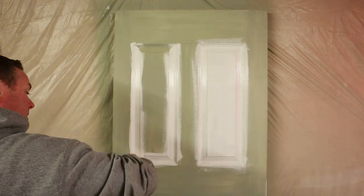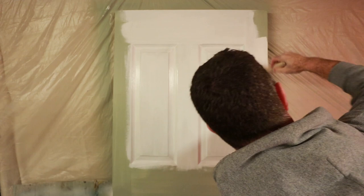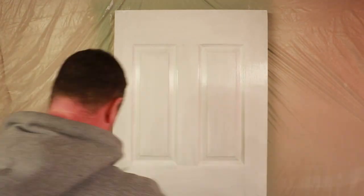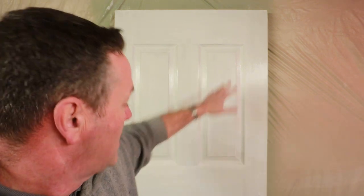Going into speed mode to finish this door off. That's gone on quite nicely. I've got a dry surface because that particular Hammerite undercoat I used is a dead flat finish, so anything you put over it probably will pull. This being an eggshell finish it's not too bad about that. The resin properties that make something shiny and make it flow out easier - it's going to be a shiny finish? No, of course not - it's eggshell. That went on quite nicely; I won't say too much for now, let's get it dried off.